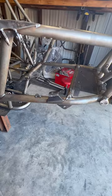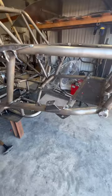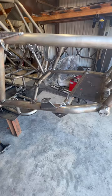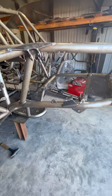We use a Griffin 27 inch by 16 inch, 1¼ tube, 2-row aluminum radiator. And then we designed an in-house radiator fan shroud that accepts 12 inch fans instead of the 10 inch that come with that size radiator. So plenty of airflow, keeps the rig super cool.